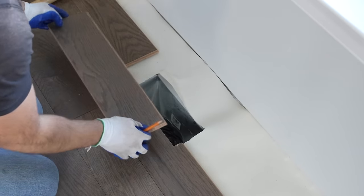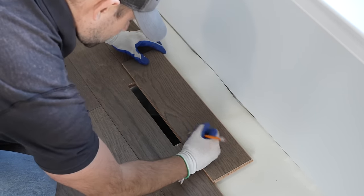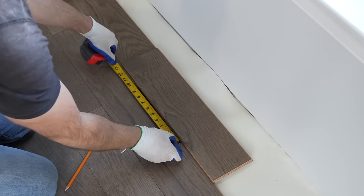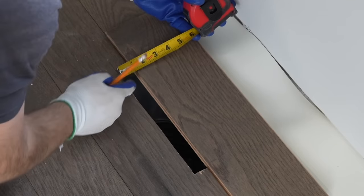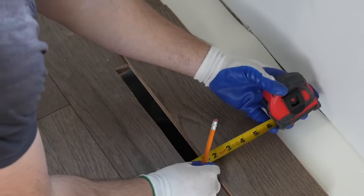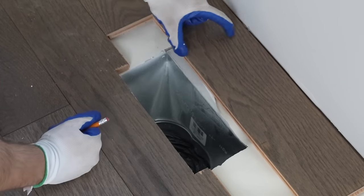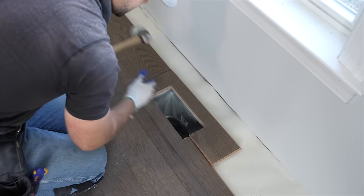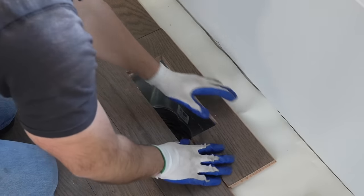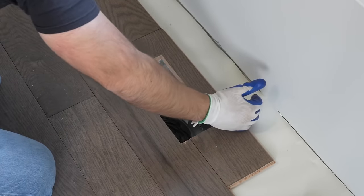When you get your flooring up to the vent where you have to cut the next piece, lay it where it's going to be installed and mark the edges. Measure to double-check the size of the floor vent — we're right at 10 inches. We know we need to come four inches off this edge, so hold it off the cut from the previous piece and mark four inches back. Alternatively, measure the difference — we've got one inch, so come three inches back onto this board to give us a four-inch cutout for the vent. Fit it into place — it looks good. For a piece tight against the wall that's hard to pull into place, wedge against the wall to finish it up.